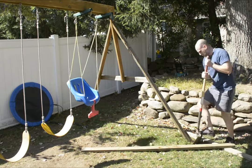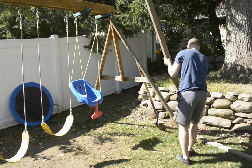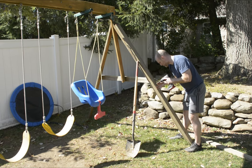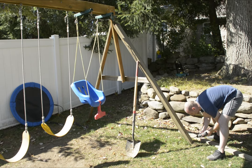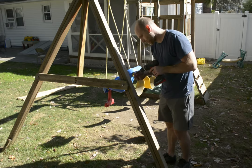I forgot to move the two-by-four before digging the hole — that's my mistake. Just go ahead and dig a few inches and embed the two-by-four in the ground — nothing crazy, just get a nice firm seating. Then go ahead and screw it in place. I think I used about six screws in total: two on top, two in the middle, and two at the bottom. Then do the same on the other side.